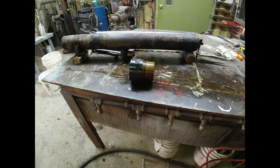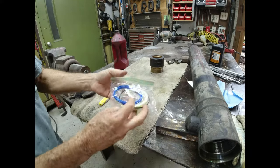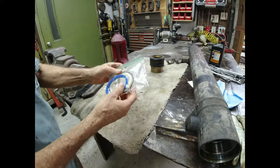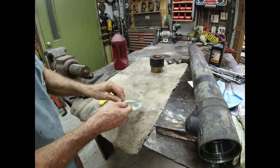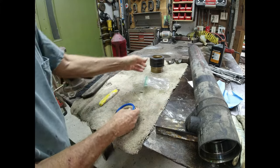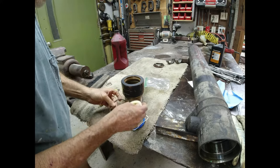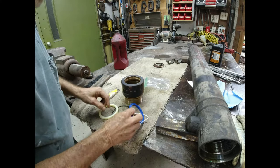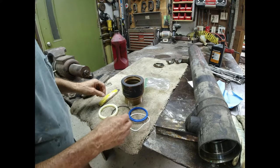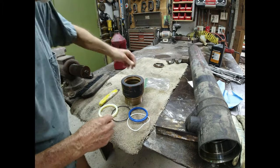Look what I got today - 85 bucks. That's about $55 an ounce, but anyway, had to have them. It's a rainy day so it's a nice rainy day project putting this thing back together. It shouldn't be hard because I remember where everything goes. This is the seal and it goes in the bottom joint, this is the wiper and it goes in the top joint, and the O-ring goes on the outside. I'm going to put a little bit of oil on it just to make sure it will slip and slide.